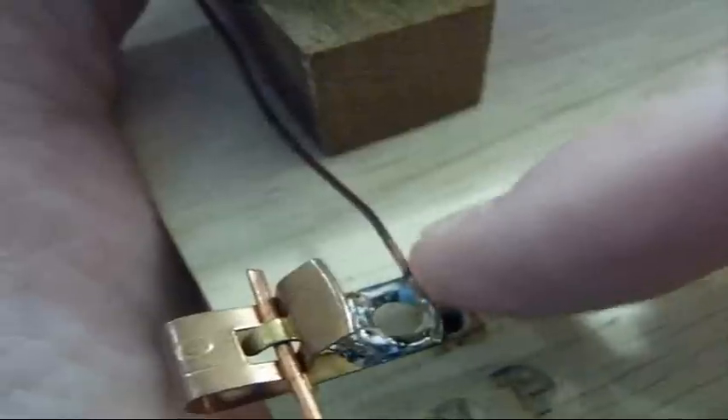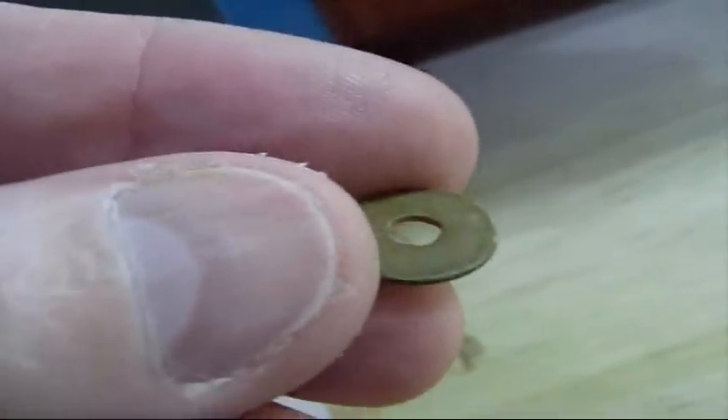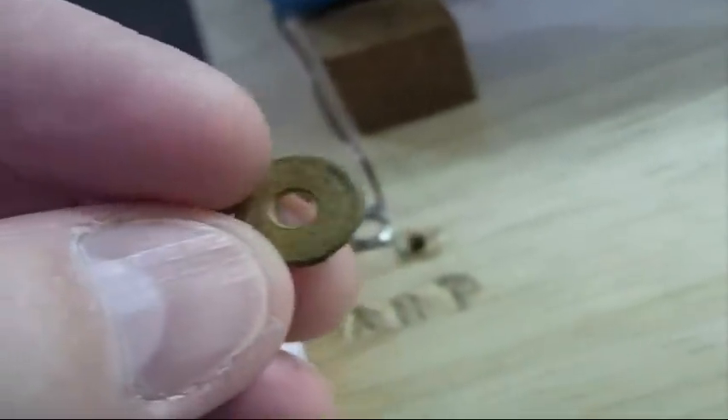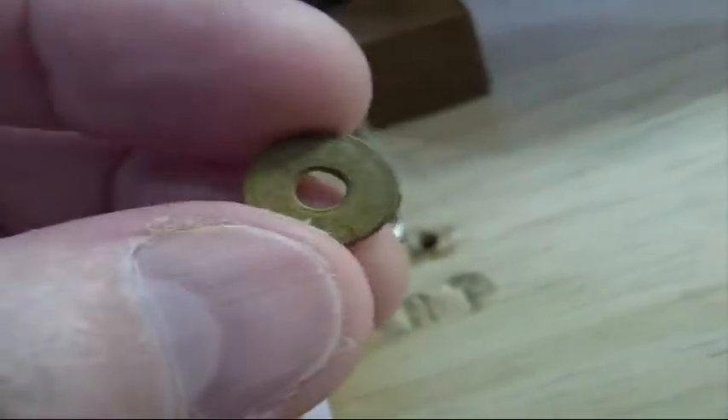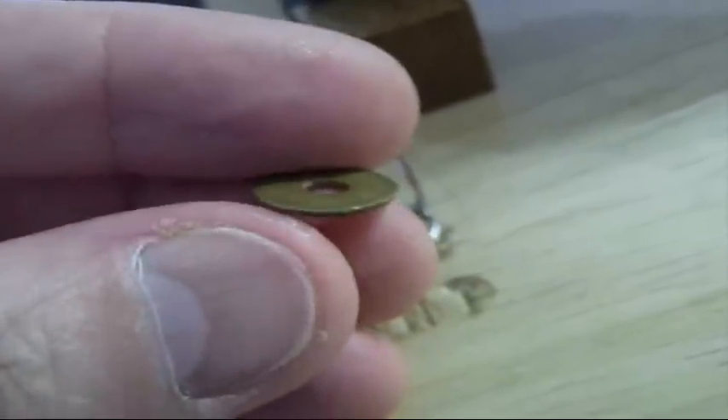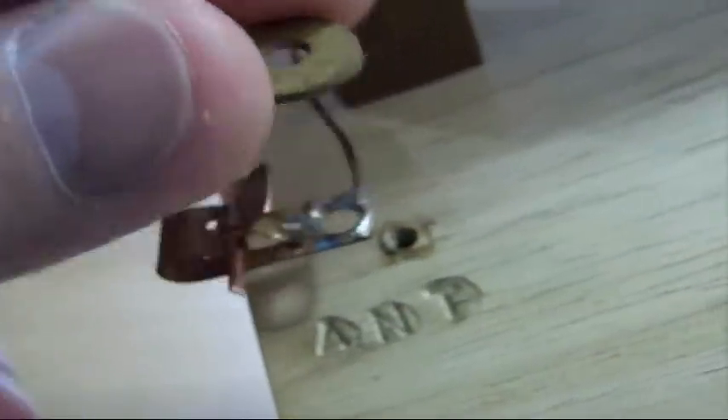Get that enamel off there, put it around there, and solder it if you're going to. If you're using a brass washer instead of clips, that's okay too — just loop the wire around the brass washer and solder it on. You cannot use stainless if you're going to solder — stainless and solder don't get along. So I recommend brass. You put the wire loop around, solder it on, and when you put the screw through there it'll make good contact.